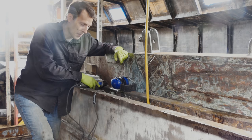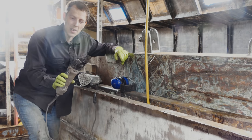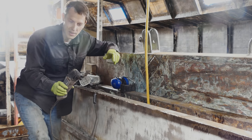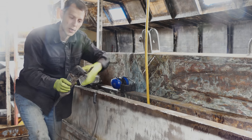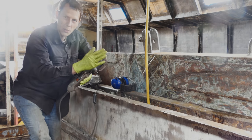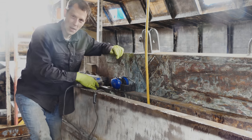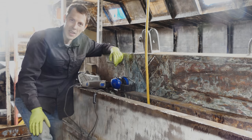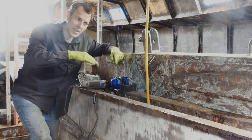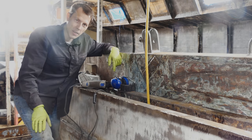I'm a little concerned that I won't be able to get to the absolute center. So what I'm doing — I'm using this Dremel oscillating tool, and I've got a cutting bit on here. A scraper would work the same, because I'm not using the front edge of it. I'm using the side and this front corner here. And when it rattles back and forth against the surface, it chips away any loose flakes of paint that are there.